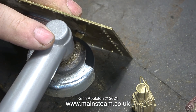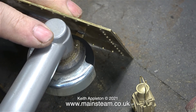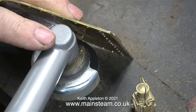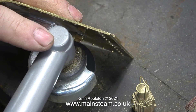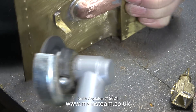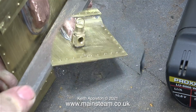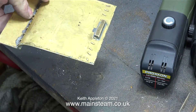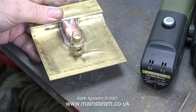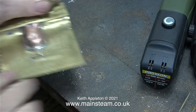The bracket was now the right width but still a bit thick, so to save a bit of time I used my Proxxon angle grinder to thin it out a little bit and also to thin out and shape the end. I didn't finish the job with the angle grinder - for that I used the file once again. The bracket now fits perfectly into the lamp and holds it in place even when it's upside down and I'm shaking it. The lamp is a firm push fit on the bracket.